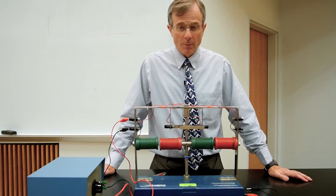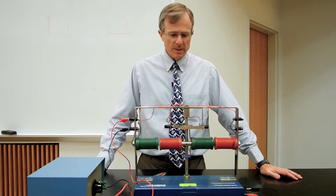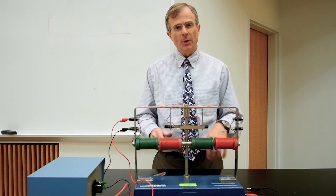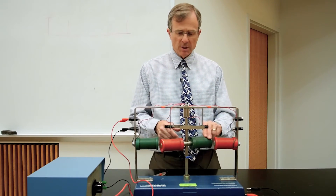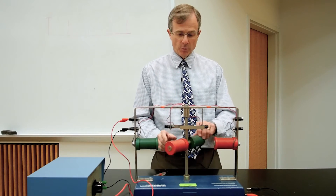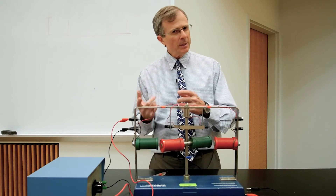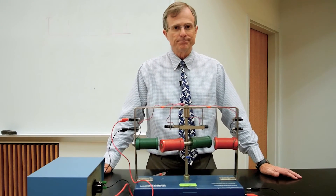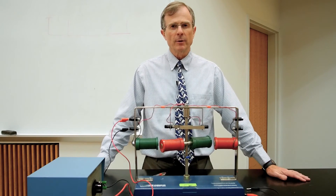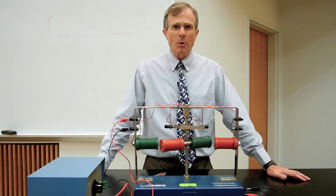This is a regular motor with brushes. There are also brushless motors that don't have a commutator and don't have brushes, and they control the motion of the rotor — this is called the rotor — simply by controlling the amount of current to each of the electromagnets. These are used in Segways and other electric unicycles, that sort of thing. So that's the way a motor works.